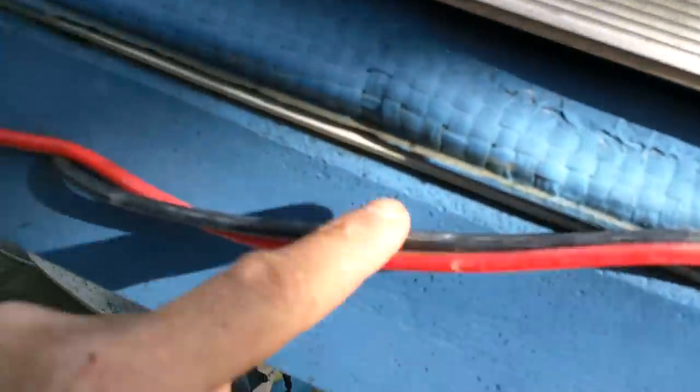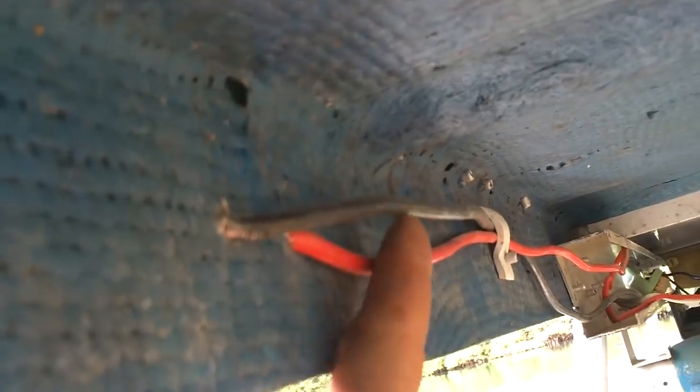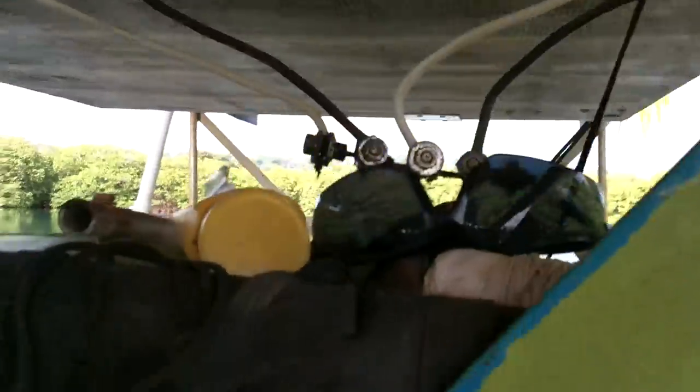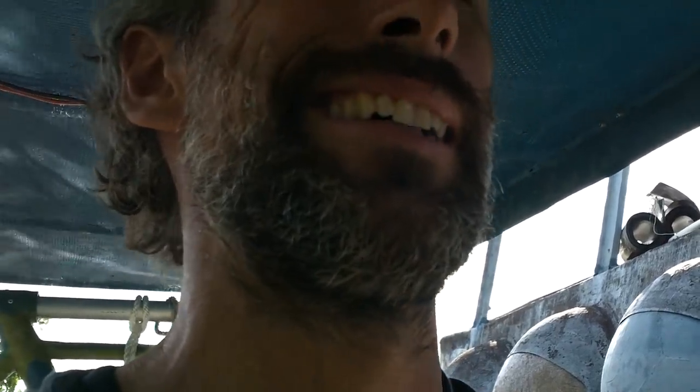So my wires will have to come in here, and then once they get under here, I can put some blocking diodes so the electricity doesn't accidentally go back into the solar panels. I did have my blocking diodes over here, 5 of them. I'm gonna need 5 more since the solar panels aren't connected in pairs anymore. They're all gonna be individual. So each solar panel needs its own individual diode now. And the diodes just protect the solar panel from electricity going the wrong way, like into it, burning it out.